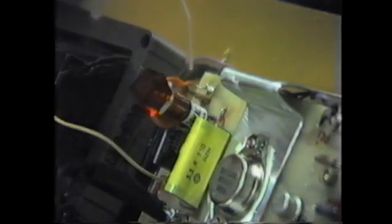We're at an angle to the machine now, and if I go over here, what you're basically looking at is the firing of this spark gap where I'm pointing here is a little blue arc, and what that's doing is creating those resonant peaks on top of the spike. And the resonant peaks, once again, look like this. You can basically see the neon fire and then the spark gap fire.